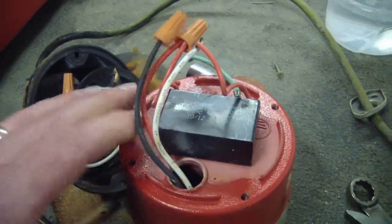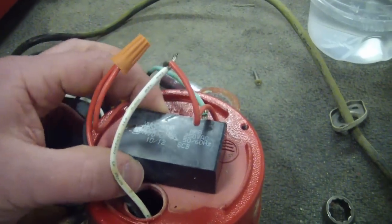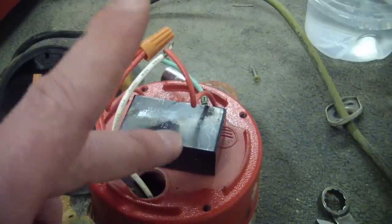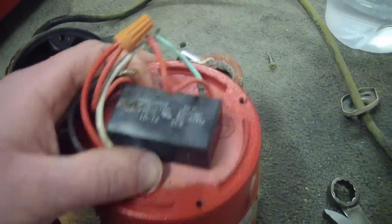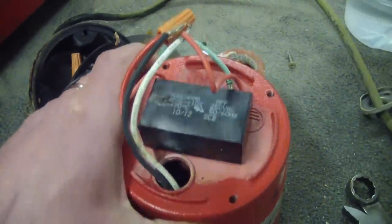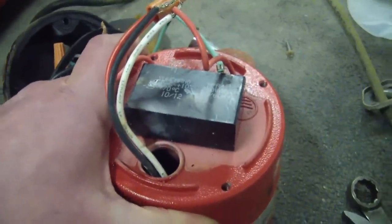What's happening here is there are actually two separate field windings. One gets fed from the hot and the other gets fed from the capacitor. Going through the capacitor offsets the phases — one phase will be lagging — and we essentially get two phases out of a single-phase system in order to get the motor to start rotating and maintain rotation. Of course the power factor is going to be horrific, but I didn't have any problems with the motor.